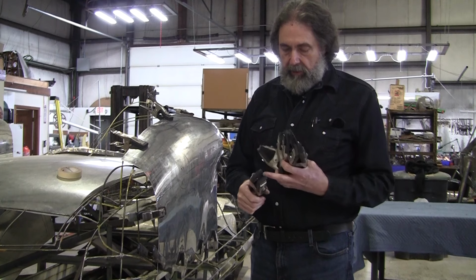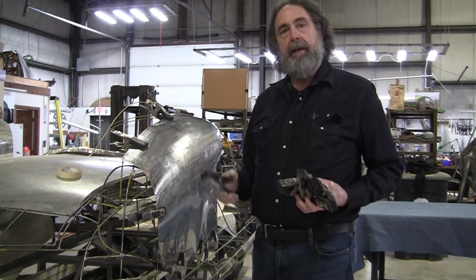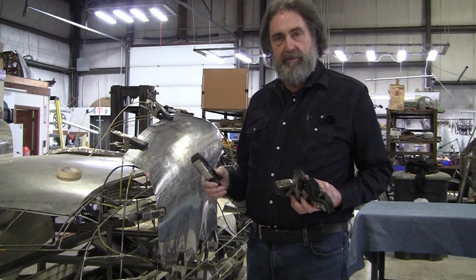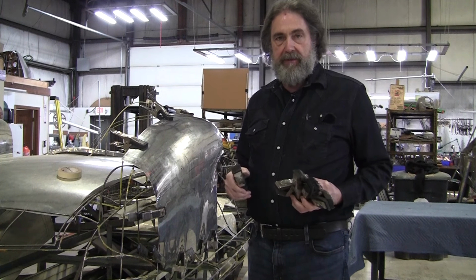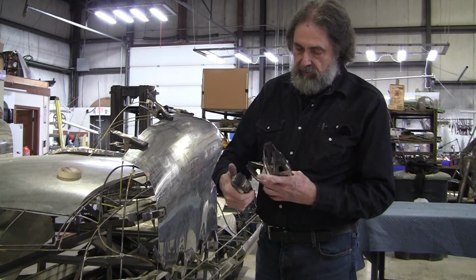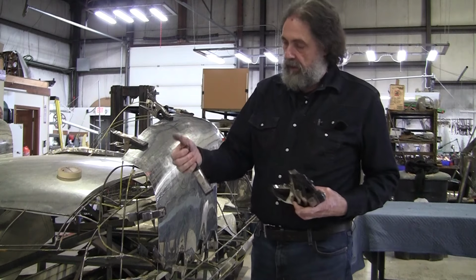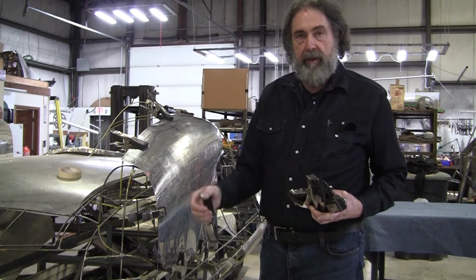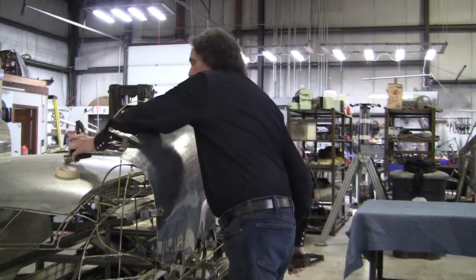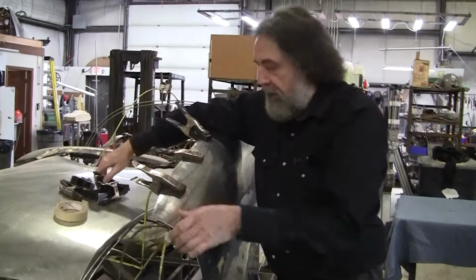And you need the rubber to go in here, and best is about half inch rubber, Tractor Supply, a horse mat, cut it up with a bandsaw, does the trick, one little 10-32 screw through here, and now you've got a non-marring clamp that has a little bit more spring to it. So the important thing is clamping this panel down.